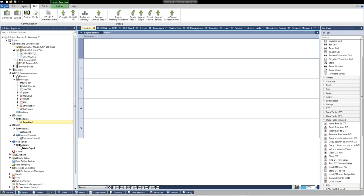Is there a way to connect it through the internet without using a DNS resolver, I believe is what you're going for? So the DNS resolver allows that remote location that you want to connect to. That remote location could have what's called a dynamic IP address, meaning that every time they power cycle their Comcast or AT&T, whoever they get their internet from, every time they power cycle the hardware, AT&T or Verizon is going to give them a new IP address for their office. And what a DNS resolver does is it resolves that changing IP address to be some fixed thing, you know, mywebsite.com. And if you have a DNS resolver and that changing IP address, you can just always connect to, you know, mywebsite.com to connect to the PLC.